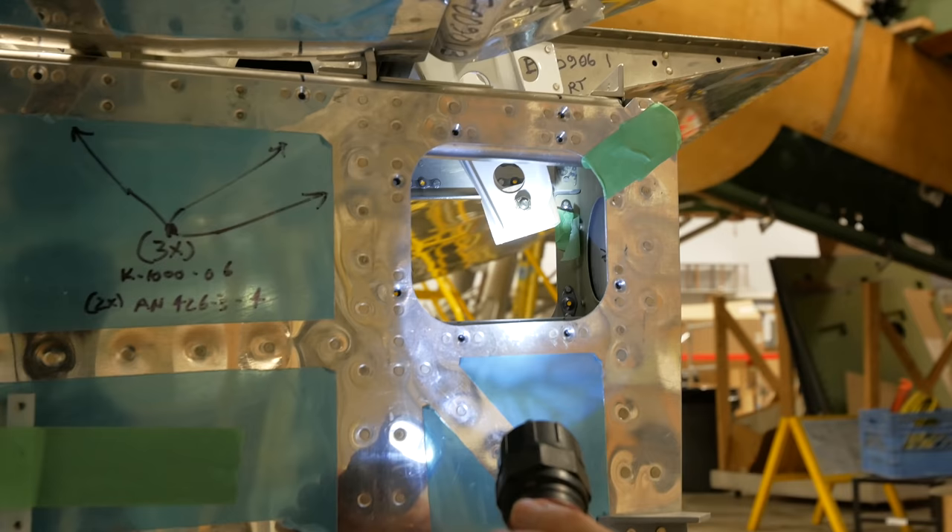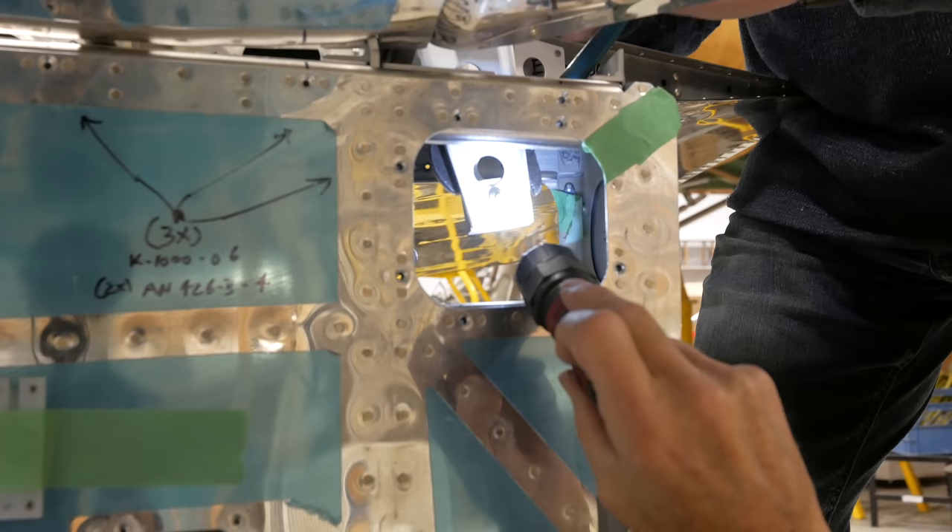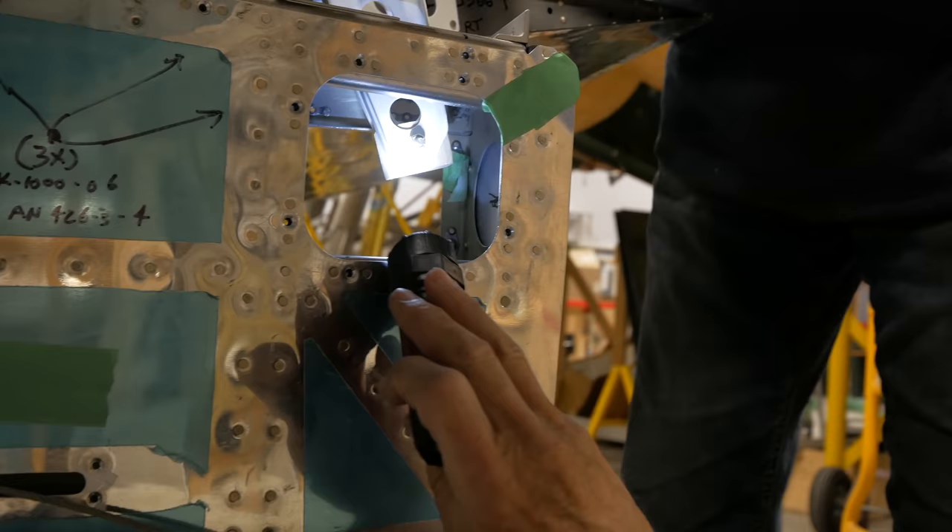You need that block in there now because the rigging isn't complete — you needed a spacer to hold that spot. We could put the rod and bearing through here, but there's no point. You knew the block was the same thickness, so it didn't matter. Those horns, relative to each other, may be clocked so they're not exactly matching each other. There's nothing wrong with ours per se; it's just that there was enough variability that the adjustment had to be made.